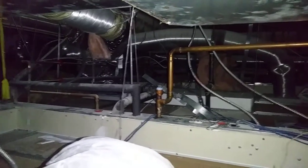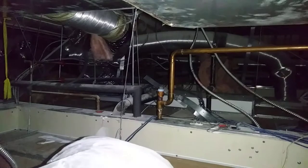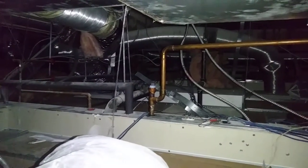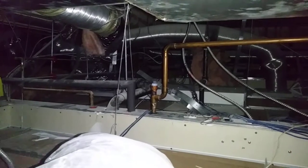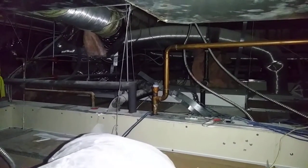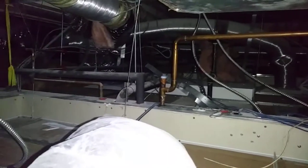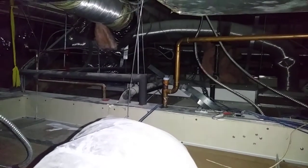And then that drops down to a sink over there. I originally set it up to drain more than one unit, but it ended up only being this one. A clean-out plug can never hurt, though. So that was kind of a multi-use thing — if I connected another unit, I'd probably re-establish that plug at the top and just put the male adapter in there.